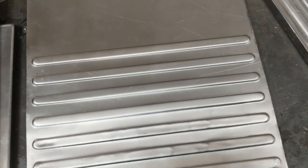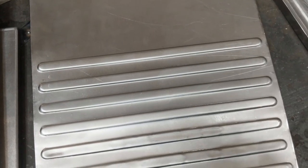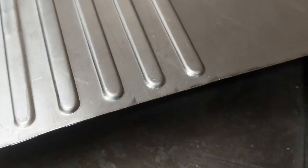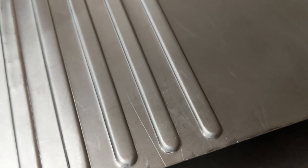But I'm not 100% happy with the spacing. I didn't account for the width used up in the tapering sides of the embossings, so the crests and troughs aren't evenly sized like they should be. I'm still debating if I should completely remake the upper and lower die set to fix it. I like being a perfectionist, but I'm not sure even I would notice the issue if I wasn't looking at a blueprint.